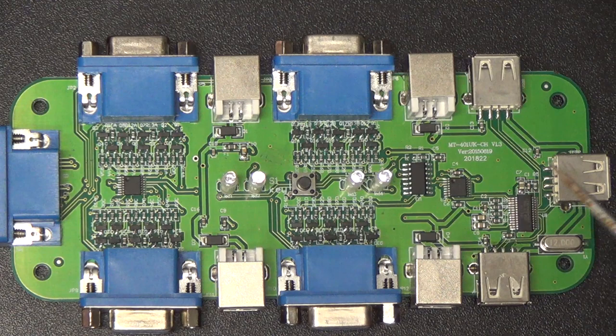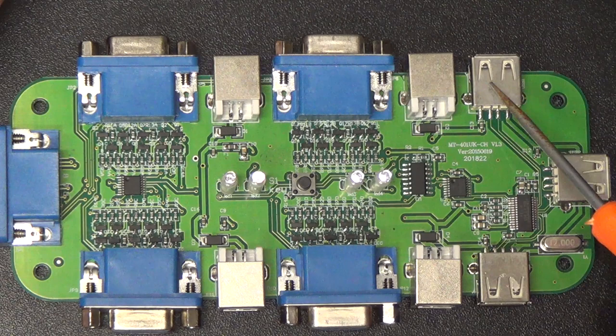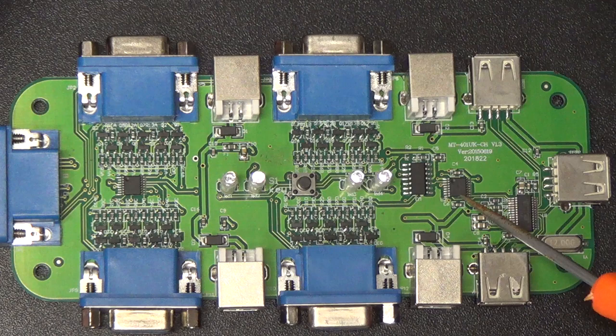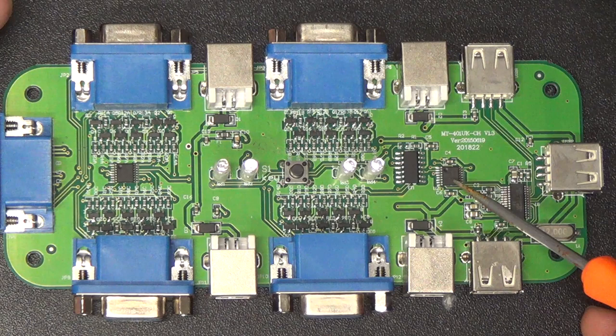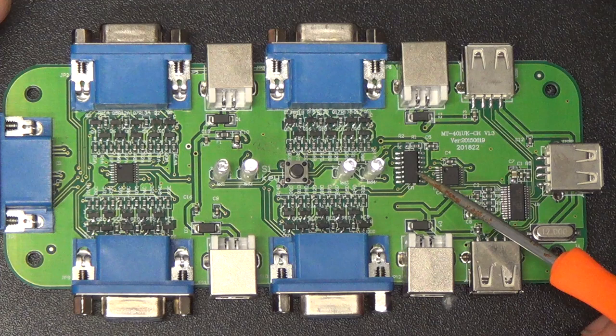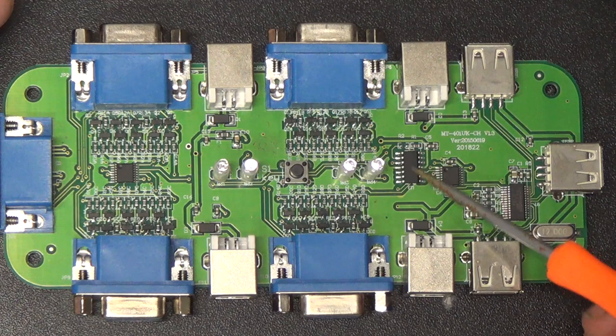Well, it's got three USB inputs here, right? For keyboard and mouse and something else, I guess. And then it must switch the output of that USB hub chip onto each of these USB ports through these analog switch chips somehow. And I guess if this is some kind of itty-bitty microcontroller, maybe it can insert a little bit of switching delay to keep the USB devices from getting confused